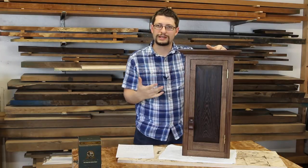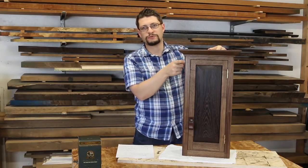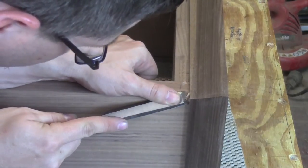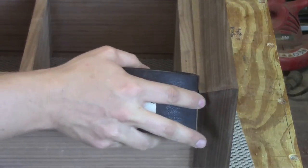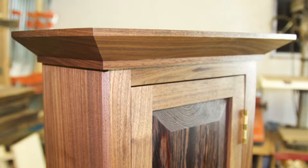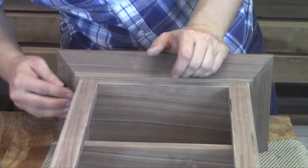I've never done it that way. I personally never had any issues — I continued the chamfer the rest of the way with a combination of a chisel, a bullnose plane, and some sanding, and it works out really well. So the chamfer is all done. I also softened all of the edges on the cabinet.